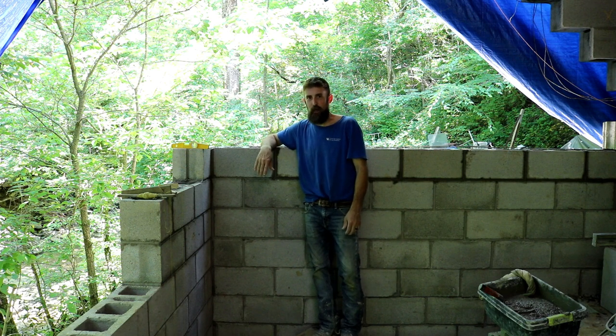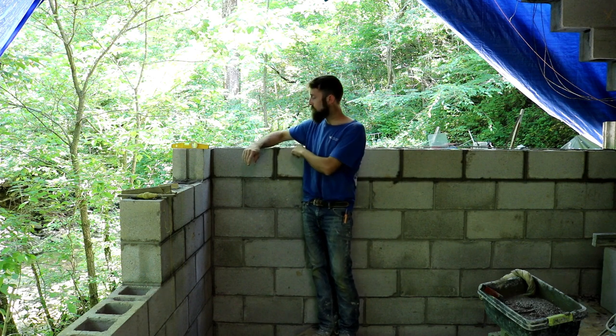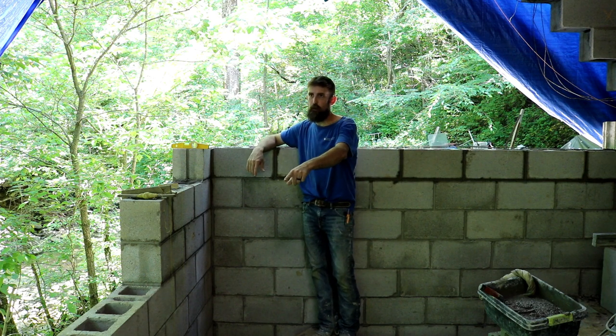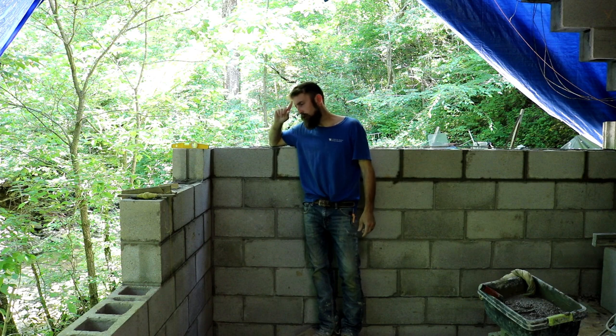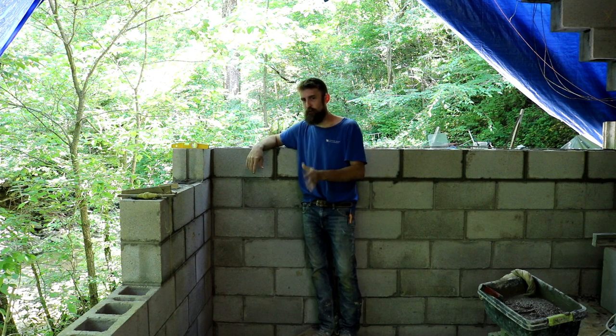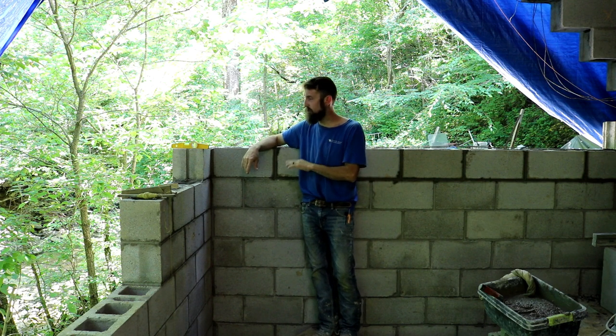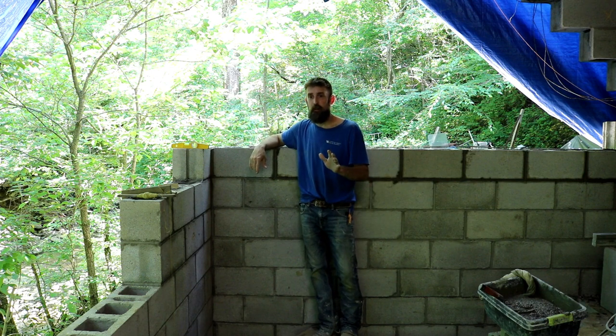It's easy to sit back and say, well, I would have done things like this. Just like, you're not putting steel in that wall. Well, I'm putting steel in every run other than one or two that I forgot. I didn't put one in the bottom. And I think there's another run, like the second run up, that doesn't have a wire in it. I just didn't think to put it in. Maybe there's two runs, whatever. It's more steel in this than what it needs. If you put steel in basically every run, this wire, it's going to be good enough, I guarantee you.